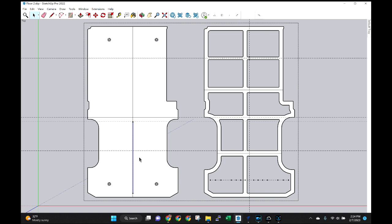I use SketchUp to enter the data points and create the models. I created the centerline for the floor and put holes in the floor to measure at three inches and 57 inches. Then I use the trilateration plugin, which allows you to enter the dimensions recorded from those two points and it traces out each point exactly. Then I just connect these points together to create the outline of the object — it works great. If you'd like a detailed video on how I did this, just let me know in the comments.